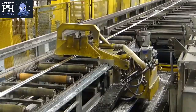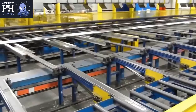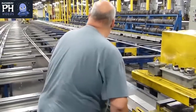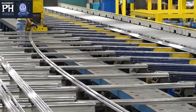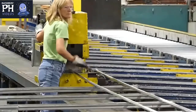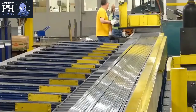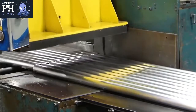The extrusion is cut at the billet seam, and the runout table maneuvers the extrusion across the cooling table. To further ensure a straight and true extrusion, it goes through a stretching process to straighten and relieve stress. The straightened extrusions are moved to the far side of the table and travel to a sawing station where they are cut to the specified length of the customer's order.